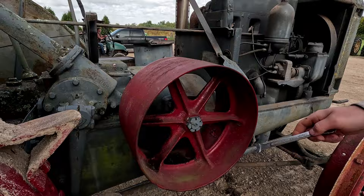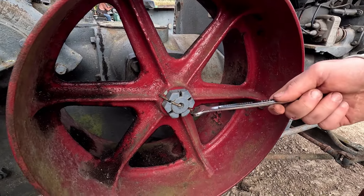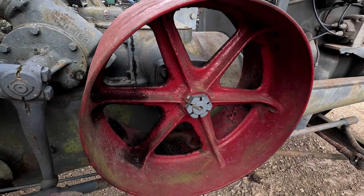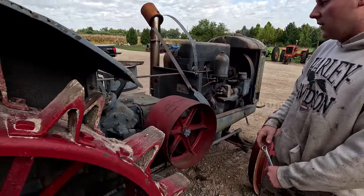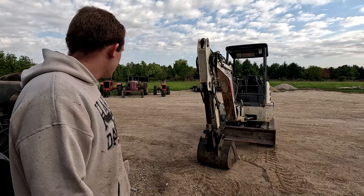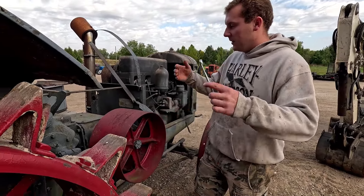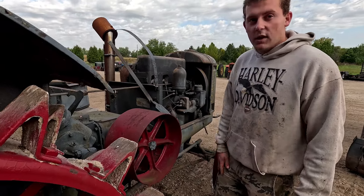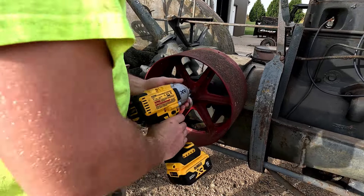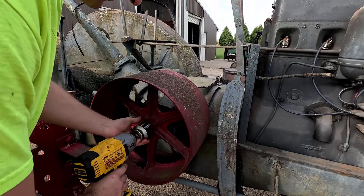So what we'll do now is take the pulley off — I'm going to get some pliers, knock that little pin out of there, get a big socket, and hopefully rattle that free, then this should slide right off. We also got a mini excavator here today and we're going to hopefully strap this thing up and pop it out and get it out of the way. We got a two-inch socket on the nut for the pulley — these usually aren't too tight — and there it is.